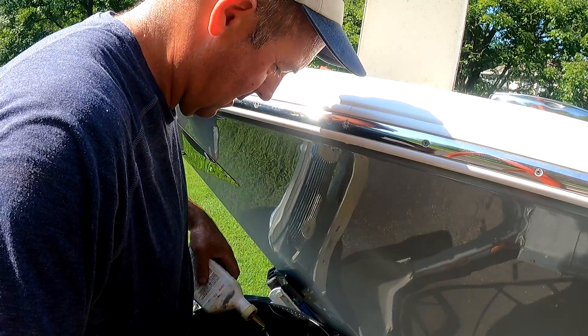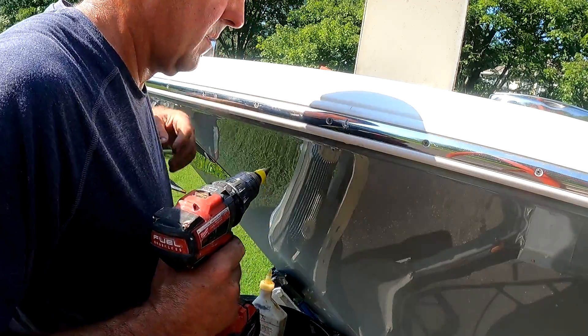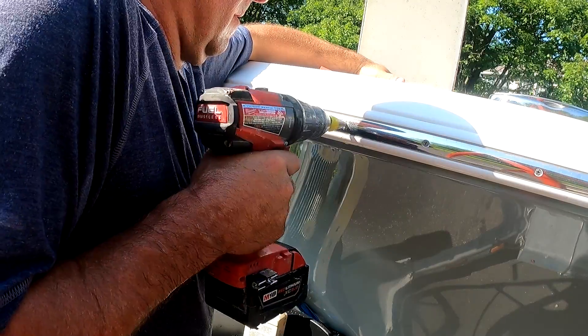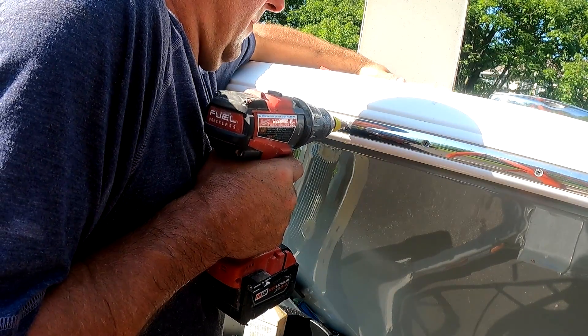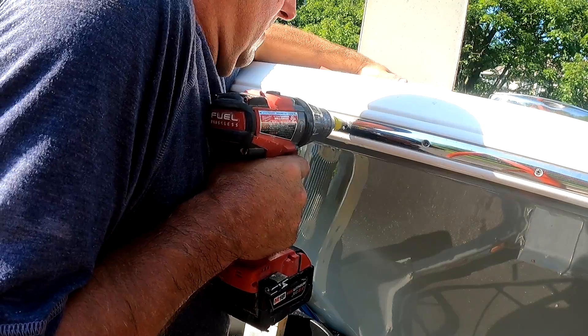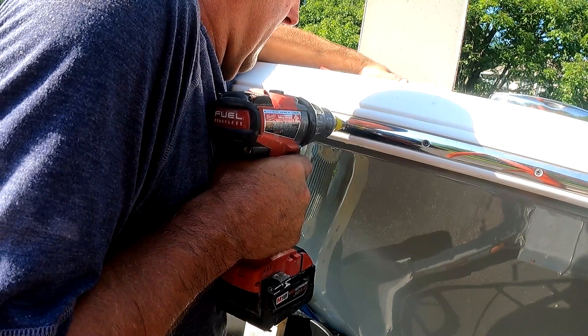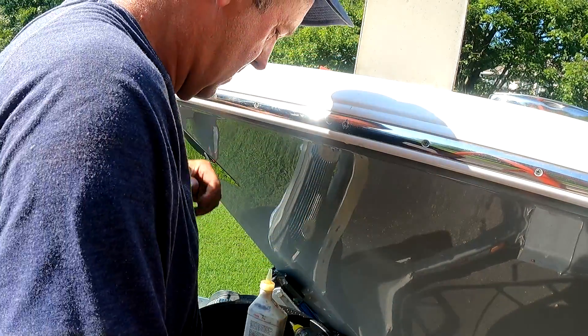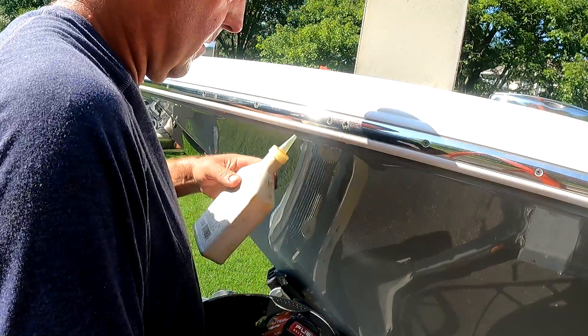Before you drill bigger holes in your boat, you want to make sure that you can also see your pilot hole coming through. Here I'm using a cobalt step bit to drill the hole the rest of the way, and you can see I'm also lubricating the bit with some oil and I have a little catch pan to catch any oil or shavings. The goal when drilling stainless steel is to use a slow drill speed — you're trying to keep the bit cool, which is also the reason for the lubrication. Steady pressure, slow speed, lots of lube, and you'll make a clean cut.